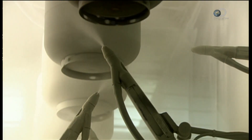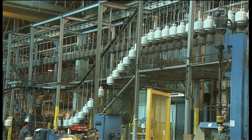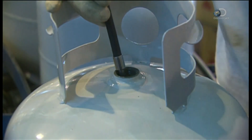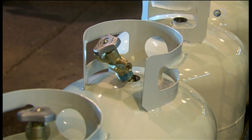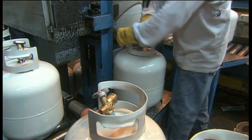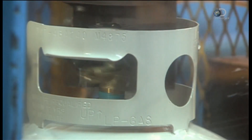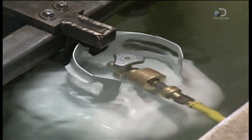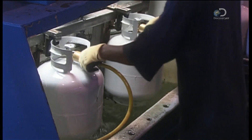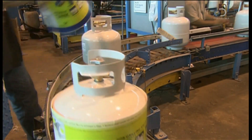The tanks then travel down a row of paint guns, which spray them with electrostatically charged powder paint. The tanks journey over three quarters of a kilometre to an inspection station, where workers check for contaminants. Then they drop valves into the flanged openings and place the cylinders in a special machine that screws the valves on tightly. In one final test, they submerge air-filled tanks in water — if the water doesn't bubble up, it means the valve isn't leaking. And after all that, these barbecue tanks should be able to take plenty of grilling.